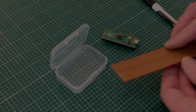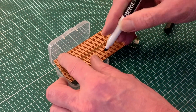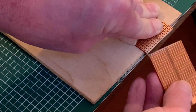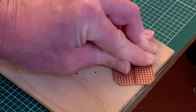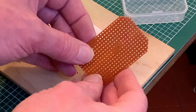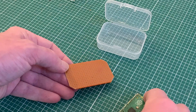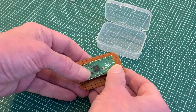The next thing is to replace the prototype's breadboard with a more permanent solution to which the Pi Pico and other components will be soldered. I found this bit of Vero board in my box of bits which is exactly the right width — I just need to trim it for length and take off the corners so it fits in the box. The board has a grid of pre-drilled holes, the rows of which are connected with copper cladding, which skips a column down the middle so each side is insulated from the other — absolutely perfect for our Pi Pico.